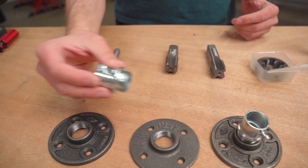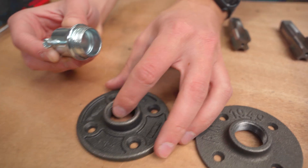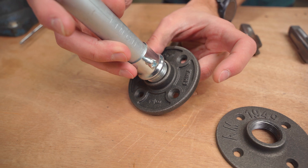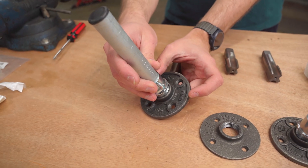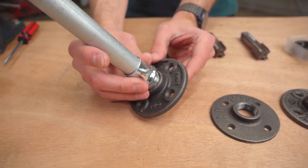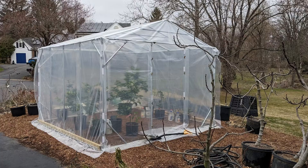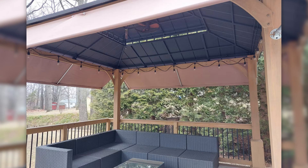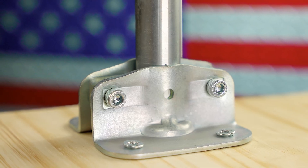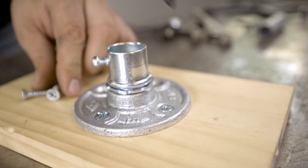The idea is essentially using an off-the-shelf electrical connector for junction boxes and combining that with an off-the-shelf plumbing flange in order to create a DIY flange that you can connect your EMT conduit to and secure your EMT conduit builds to a flat surface. A lot of people ask why you'd ever want to do this, but the community builds all kinds of things like desks and greenhouses. One of the main problems people run into is attaching EMT conduit to flat surfaces, and this hack is still utilized a lot by community members for doing exactly that.